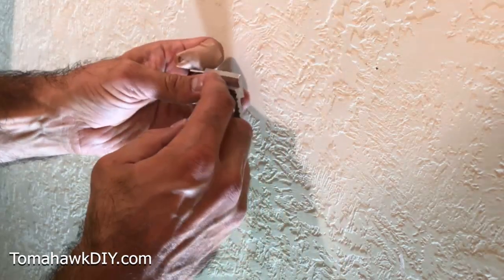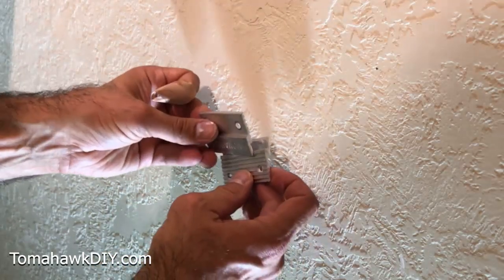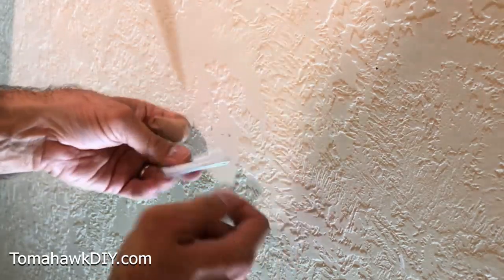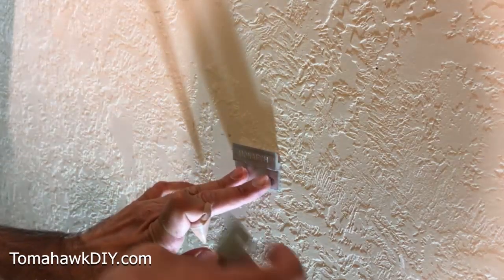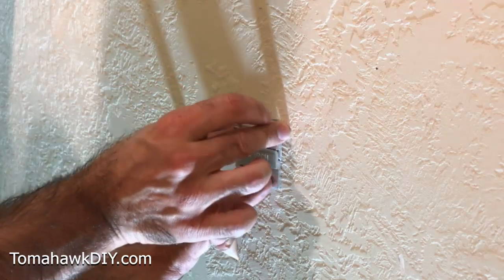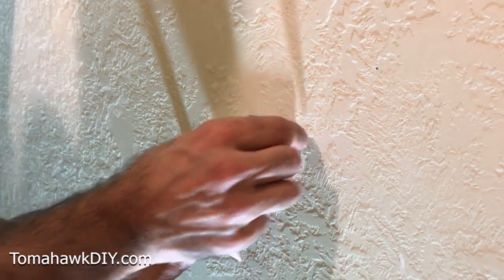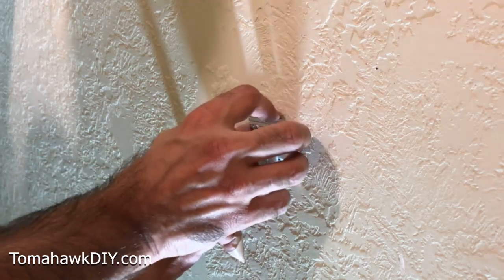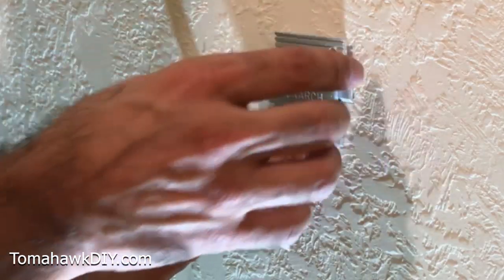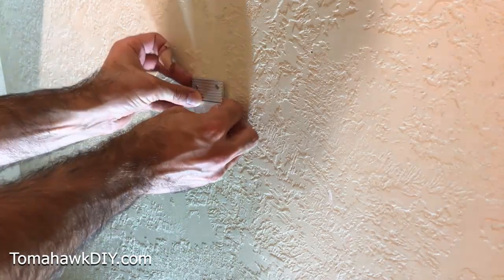They can be called a Z-clip, because it looks a little bit like the letter Z. You might call them cleats or French cleats — there are a couple of names. We're going to take one of these, secure it on the wall, then secure the upper one on our coat hook, and it just slides in like that. This can be a little more forgiving in your alignment because if you're off a little, not a big deal — it still has the support. Obviously you want to line them up as close as you can, but it can be off a little bit and you'll be just fine. So that makes this a little bit easier than the first method with the screws right in the wall.